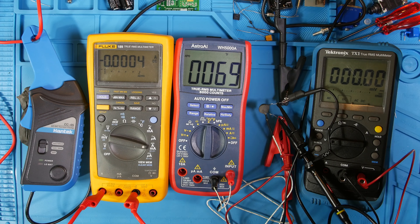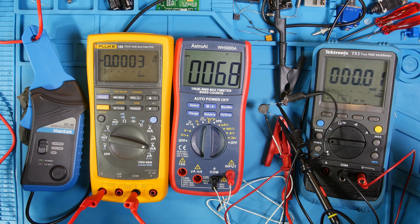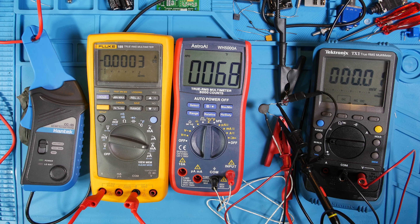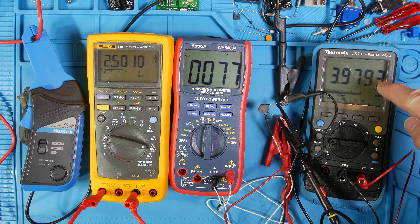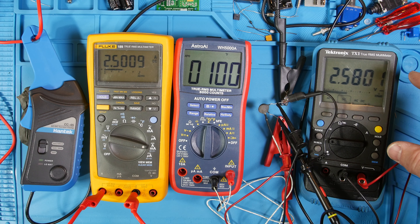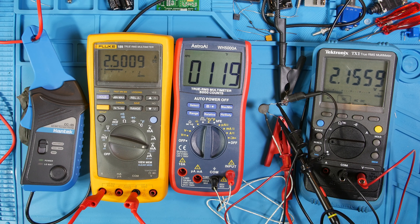We're two divisions down, so we're minus 1 amp down. I think we've got everything set. Now I have to hit the power switch — let's do that. Boom — 2.5 amps already. The voltage here is already dropping. This temperature is climbing — it's 110°F right now. 120. It's climbing. This voltage is still dropping.